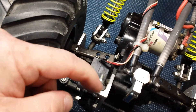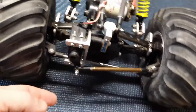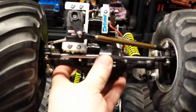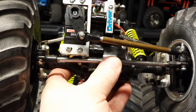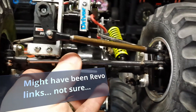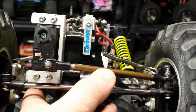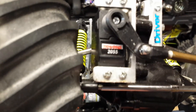The front four-link mount and its mount were all custom made from aluminum stock. The servo mount was made from aluminum angle iron — drilled, cut, filed, and finagled — with small lexan or acrylic backers to capture the servo. The steering link was also custom-made because I couldn't find an actual turnbuckle rod long enough. These appear to be T-Maxx steering rods and links, but nothing was long enough, so I drilled out a piece of brass, soldered in some all-thread, and made my own custom link.